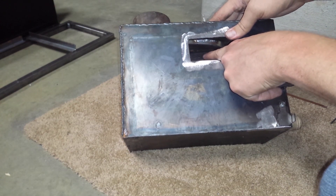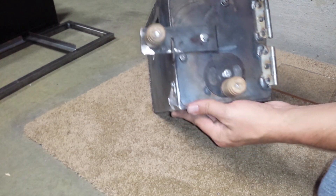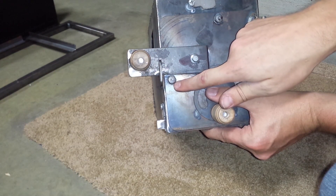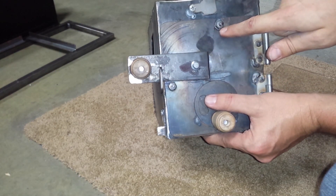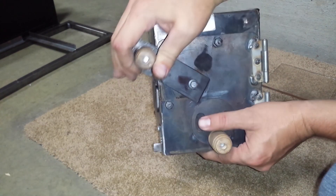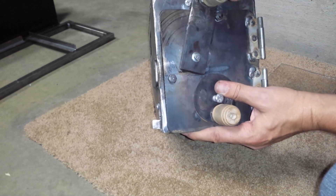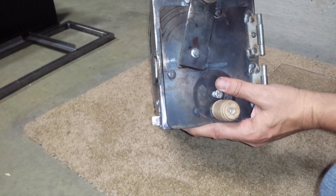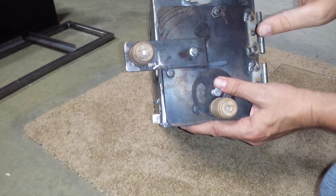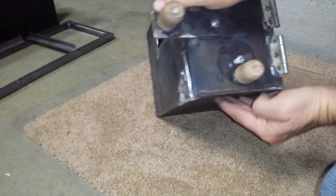One change I didn't mention in the previous video: I took a couple of nuts and welded them on here and here with a little plug weld in the center of them. The reason I did that was to prevent this latch from falling forward and from falling too far back the other way. I had a little spot weld there before to accomplish the same thing but I didn't like how it looked — I like this much better.